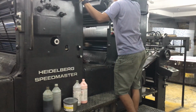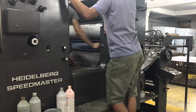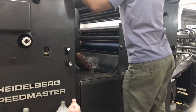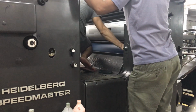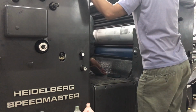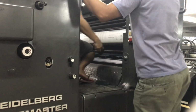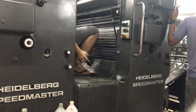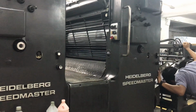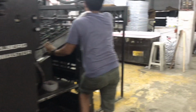At some point, the operators decided that it was the black ink that was giving trouble to all of the others. So they made a very clever adjustment to the ink that they fed into the black module. What they did was combine blue ink, or the cyan ink, with black so as to make it not a pure black, so that when they adjust it manually, it won't overpower the entire printout and doesn't make it too dark, and it doesn't give it that strange gradient in the yellow.